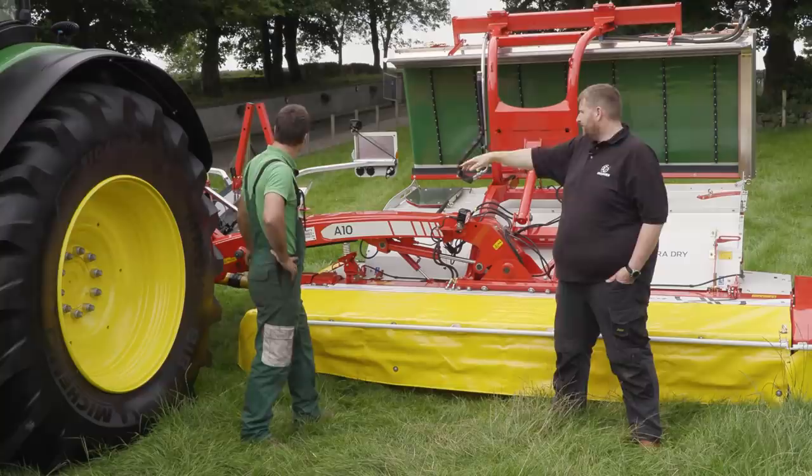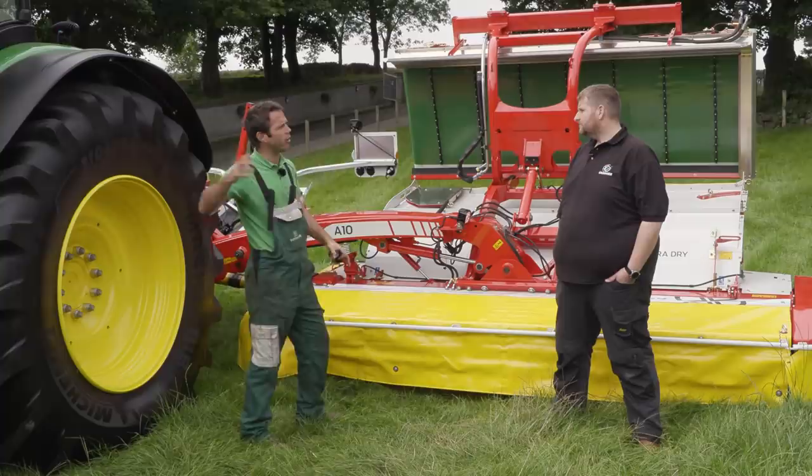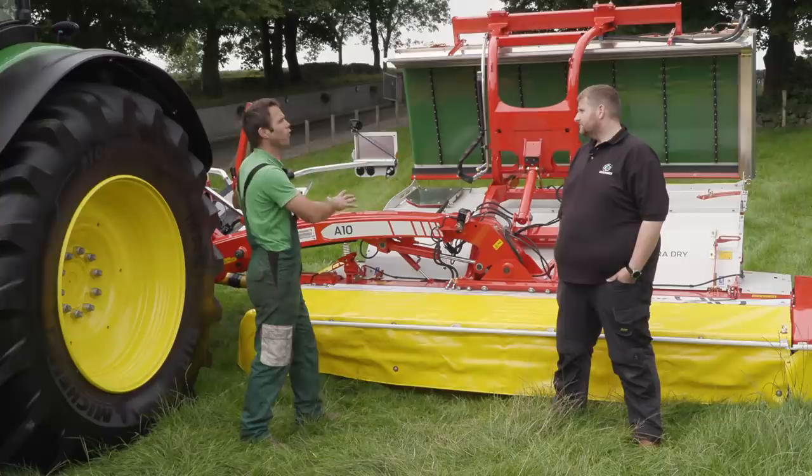But just to go back, you can down-spec this mower to anything you want. It doesn't have to be load sensing and all that job computer. It can go back to basic double-acting spool valves and a pre-select control box as well. So we have everything in between, because some people might be a little put off by all that technology. Others just adore it, you know.